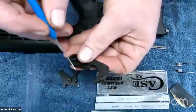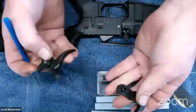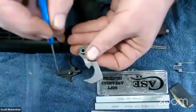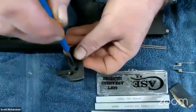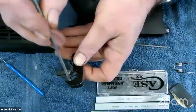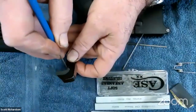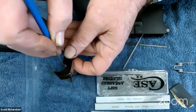The other surfaces we'll go after — the disconnector notch is a difficult one. If you just did the hammer and the sear you would get a lot of benefit and be fine. For this notch, there's a curvature that's difficult to get in and polish while maintaining the radius, so I use jeweler's files. First I reach in with a pick and feel for any burrs or roughness. If there are none, I skip filing that surface entirely — it's just very difficult to maintain that exact radius.